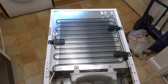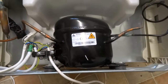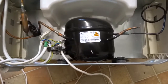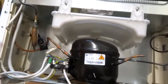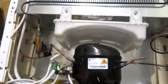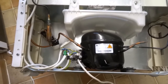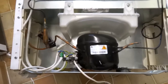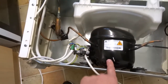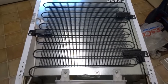I've got my fridge on its front. It's been a long time since I've done any studying on this at college, but basically the compressor pumps R600A, which is a refrigerant gas, around the circuit. It goes up into the freezer where it expands, sucks in heat, which freezes the compartment, and it comes back through the compressor where it loses the heat it's gained as it's compressed again.